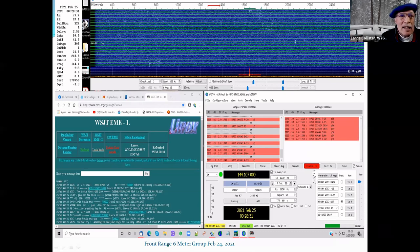But anyway, so does anybody have any questions about its use on EME? I've got some schedules, one coming up tonight with a new country on 2 meters, and then tomorrow night, a new one on 6 meters. And I'm going to be using Q65-120A, which gives me 3 more extra dB. So if JT65A is roughly equivalent, at least according to Joe, maybe even Q65-60A is maybe a little bit better than JT65A, then I should be able to get a solid 3 dB by doubling the length and going to the 2-minute sequences. So that's what I'm going to be doing tonight and on 6 meters tomorrow night to try for these new low power contacts with new countries.